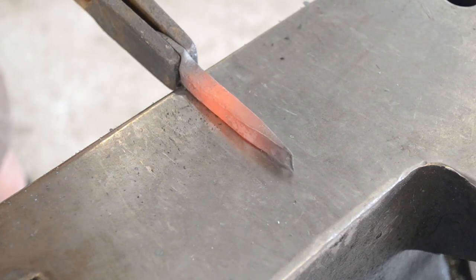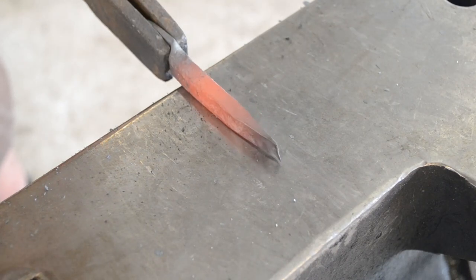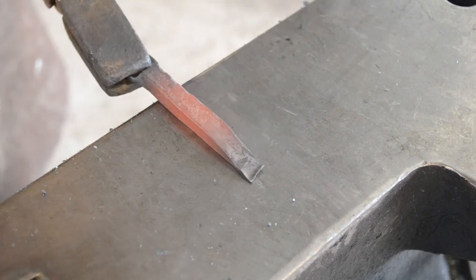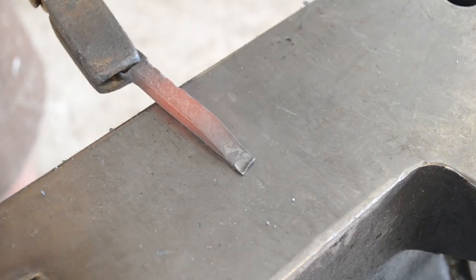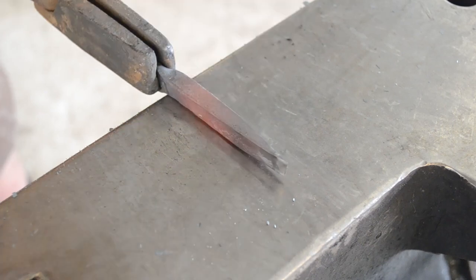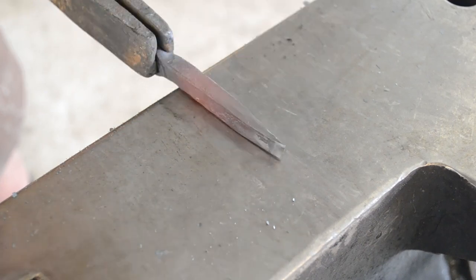We want it to be parallel sided at 90 degrees to the nib. In line with the nib, we want it to be tapered. And this is so that we can create our little tail that's going to be the keychain hook hole for the bottle opener.